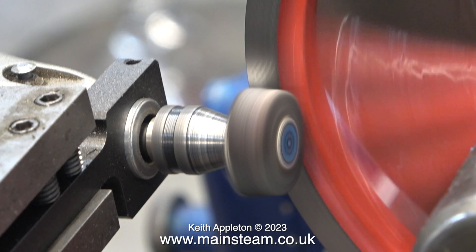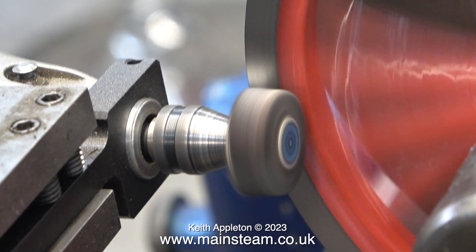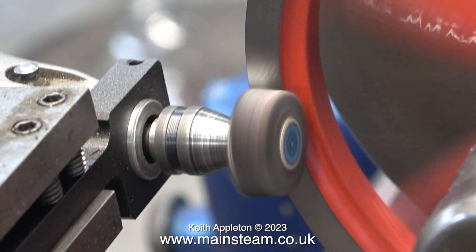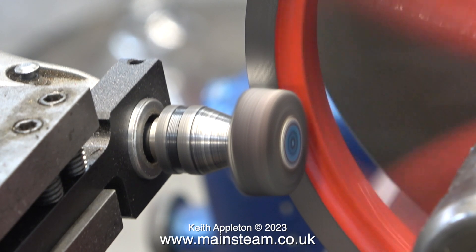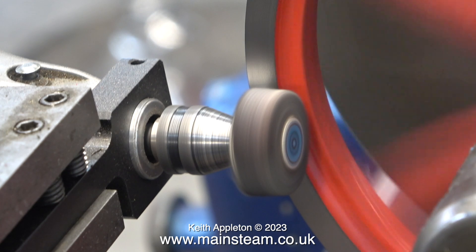In this close up, look at the rim of the flywheel and you can see these very very fine grooves. These lines are caused by using a faster spindle speed and a very fine slow cross feed — entirely the opposite to the turning operation.